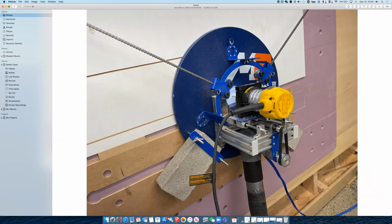They hang down below the bottom of the circle of the sled. Yep. The other effect they're having is, if the sled comes close to the edge of your workpiece, the center of gravity is going to shift over to the right, if you're going to the right, as that brick on the right is hanging further over the edge, right?